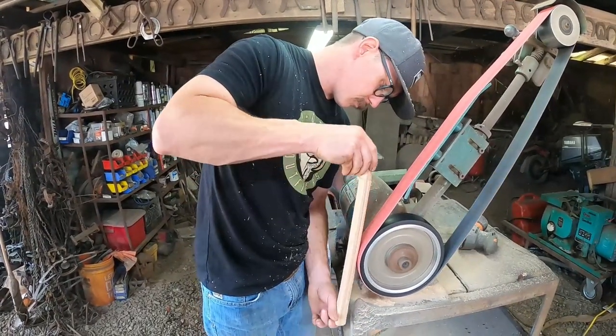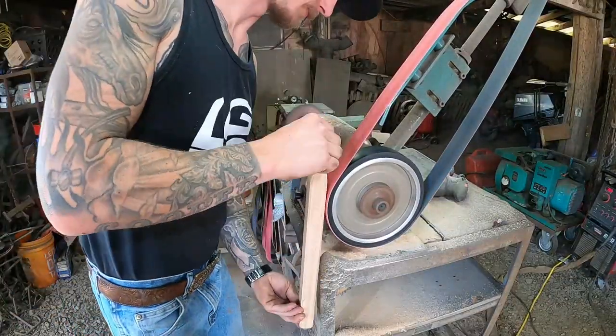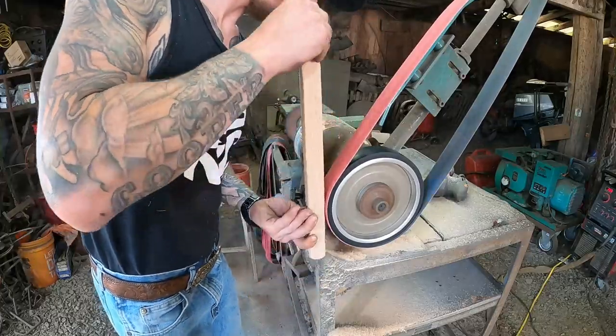All for the 36 grit. Now, are you going to go to a finer grit, you said? Yep, I go to a 120 flex J-flex belt, so it's not as stiff, it'll roll and round, so the edges won't dive in. And also, I'll take a lot of these.